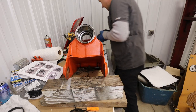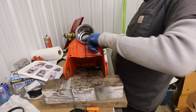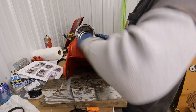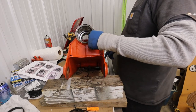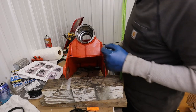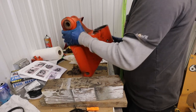And there's nothing on the housing. The housing's got nothing on this side. There's no seals or anything. Although there's a little bit of a gook line here. So we might try to just stone that a little bit with some 3M Scotch-Brite. That's what I'm trying to say. Some Scotch-Brite. Let me show you this other side here of the housing.